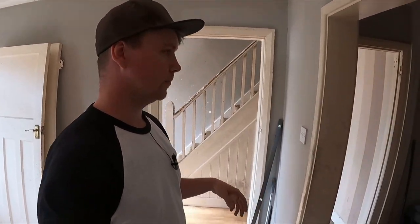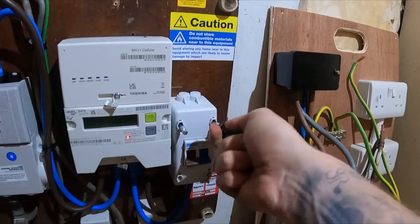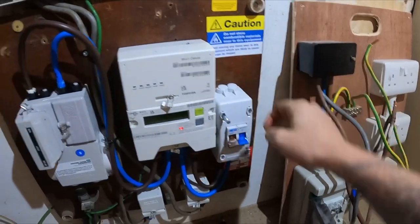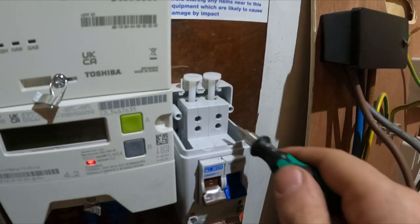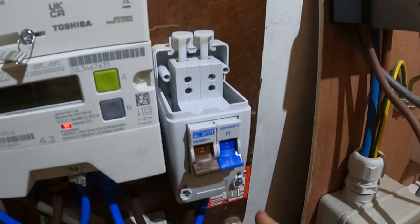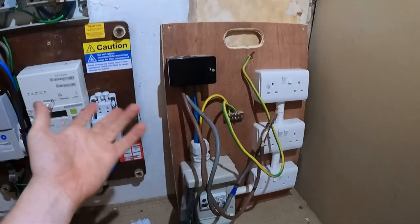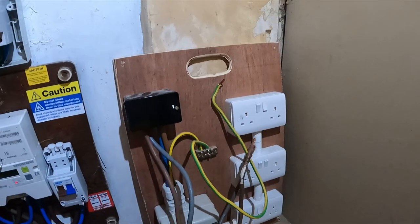Most new isolators come with a hex bit — a star bit — on them. If you've got a Tool Check Plus it can't go wrong and it fits lovely in my new bag. These plugs are designed within the terminal that I tighten onto to stop people playing with them — same as the plugs at the top of the meter. I'm going to drill this board to the wall here to stop someone knocking it over, because we don't want the main tails being pulled out of the Henley block.